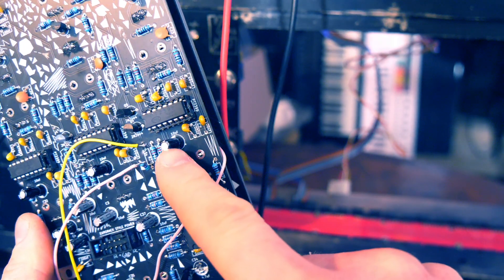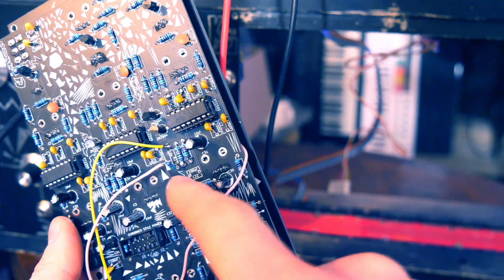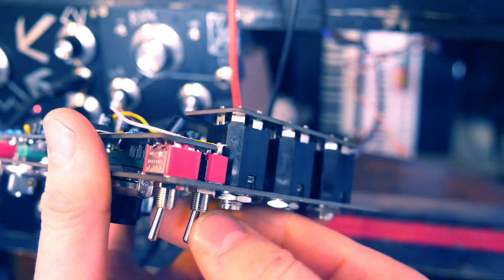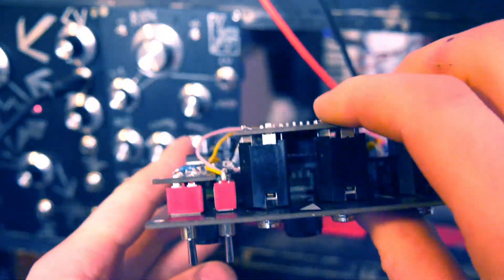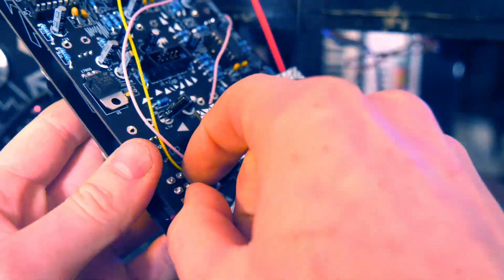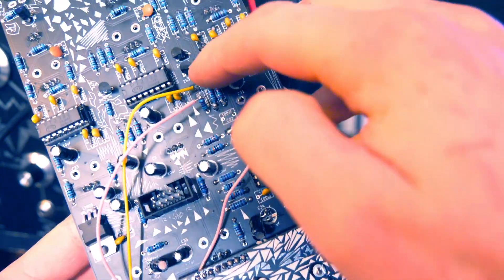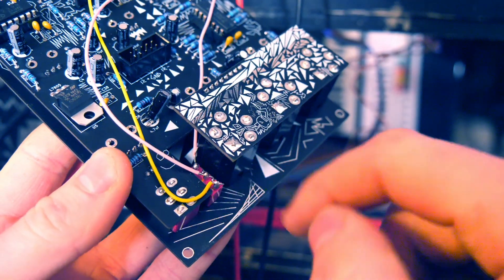If you want it hardwired, you find the positive leg of capacitor C31 and wire it straight to the resistor there. However, I've also figured out a space where you can put a single pole dual throw mini toggle switch. If you drill a hole right here — I did it by eye and was reasonably lucky — there are pictures on the website. The middle leg goes over to the top of the R27 resistor.